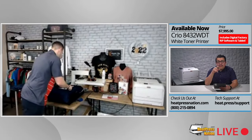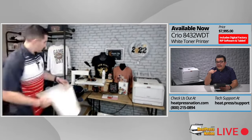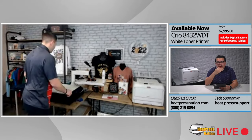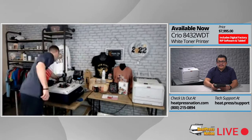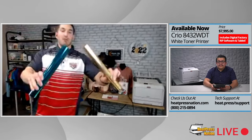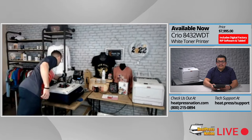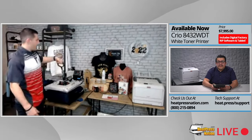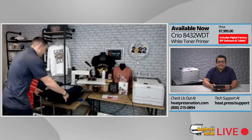Yeah. And with the white toner laser printers, it's not just the CMYK that you could do. You guys have hot stamping foils, right? Yes, correct. At the end of the day, we can really produce any color we want because our foil will stick to our toner. So we can do names and numbers, and really cool, intricate designs, without having to cut and weed and still be able to do the foil look. Very cool, very fun process.